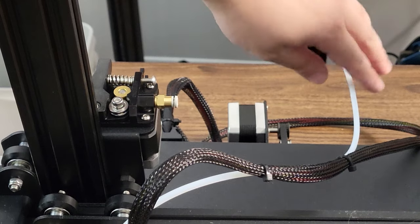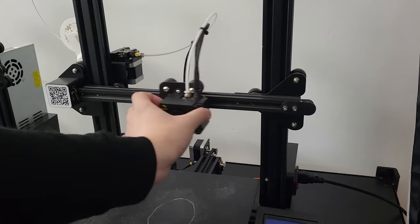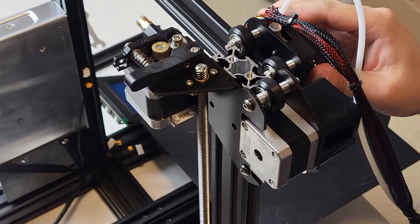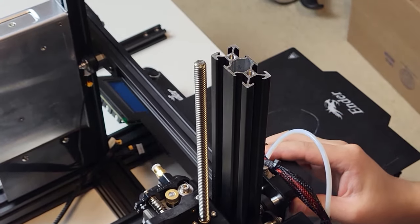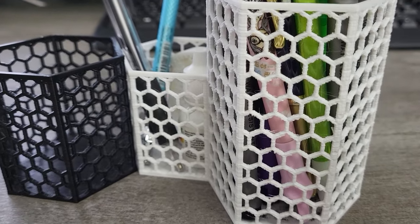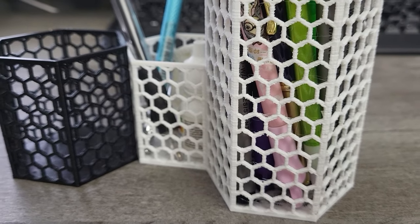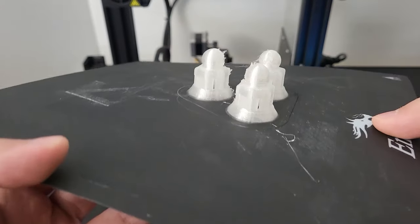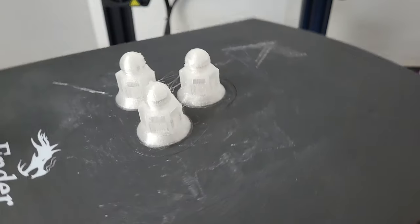The Ender 3 and Ender 3 Pro come with a Bowden setup. It reduces the weight on the printer head, making it able to print faster and better. At the same time, they could cut costs by giving you just one Z-axis. However, a Bowden setup does not do well with models that require a lot of retraction, or filament that requires more retraction, like TPU. Generally, a Bowden setup will have more stringing issues.